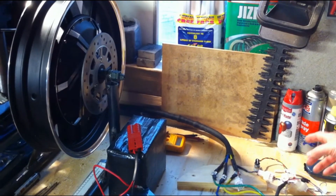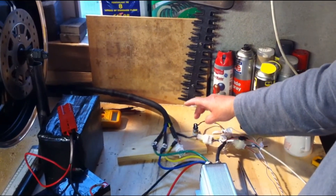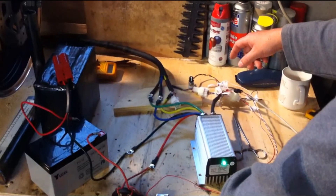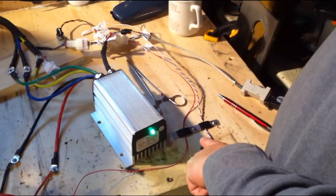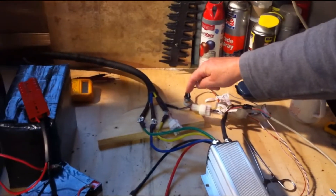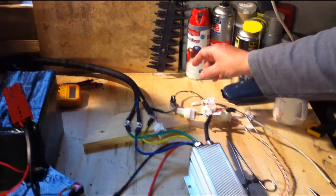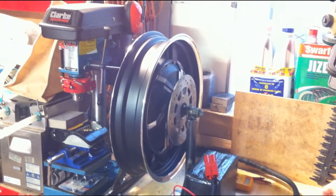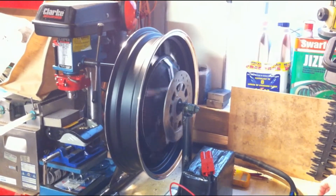I've changed the configuration setting now for potentiometer mode so it works forward, back, and also with the foot switch — which is actually this button here. The potentiometer is now at the midpoint at 2.5 volts roughly. If I press the switch and then go one way with the potentiometer it will go forwards, and the other way it will go backwards.